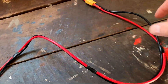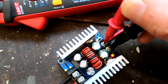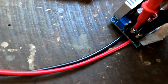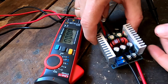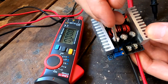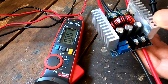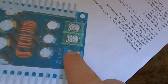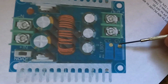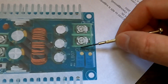We've got the solar side coming in with 30.5 volts as our input, and on the other side we have an output of only 3.45 volts. On this converter we've got two blue little boxes with a dial knob on top of each. One is for constant current and the other is for constant voltage, and this is exactly the method you should use to charge your lithium batteries regardless of what they are.